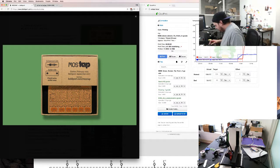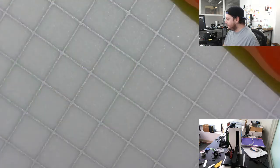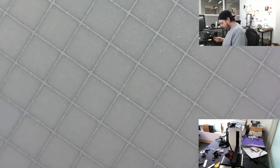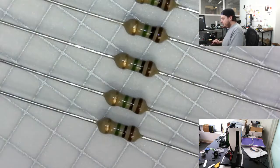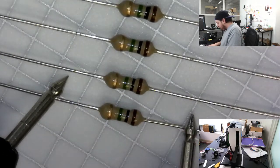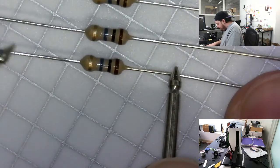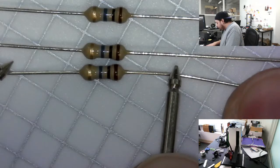Bring in my multimeter here, and put it into ohms mode. All right. Sorry, let's try and get there to be something for you to see here. So... probe across these, and these are the 1 megohms, all right. So that would make these 10 megohm. Yep, there was 10, 9 something megohm.